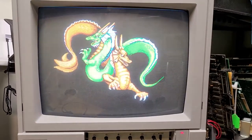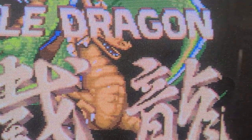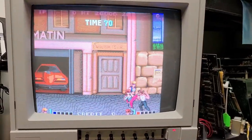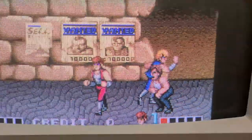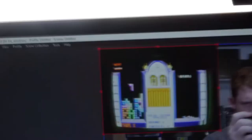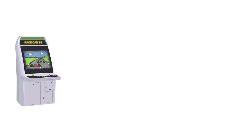I specifically wanted to create a budget digital capture solution, and one that I could use to drive the original CRT, whether on my bench or in a real arcade machine. The image often has a rolling line or flashing screen, and because all my cameras are webcams with limited configurability, I can't adjust the shutter speed finely enough to fix it. It's also just generally low quality. When I'm streaming, I really can't see the CRT because I have a shroud around the monitor to block out glare. I'm usually looking at my broadcast software preview, which is very small and somewhat delayed. I need to use the CRT as part of my bench equipment because it's analog and will just show the video signals directly, even if they're not to spec, and that's useful for diagnosis.